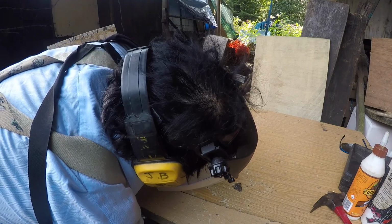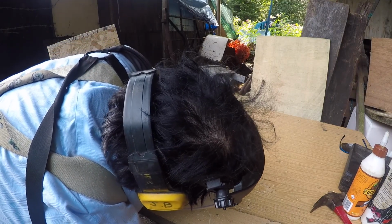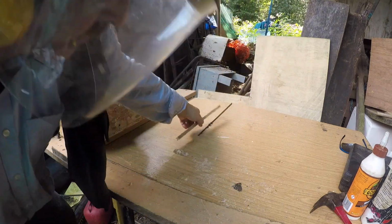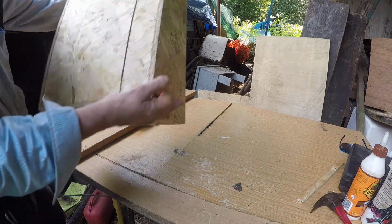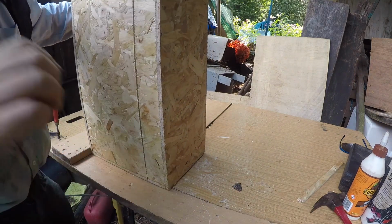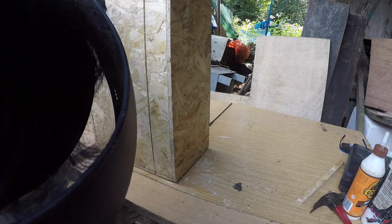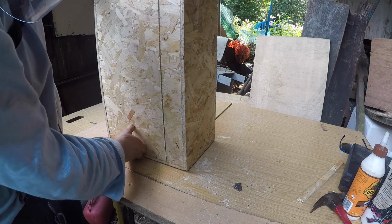So essentially I create the box, but I keep the thing together until I'm ready to cut it by hand. Now I'm lowering the blade so that it's just below the height of the material, leaving a little tab which will hold the ends on and stop the thing from coming loose when I don't want it to. Having set the blade height, we just run through on the two other ends which haven't been cut yet.